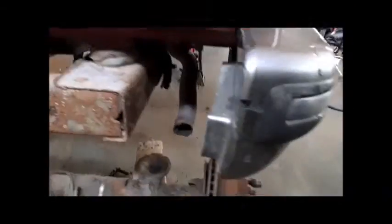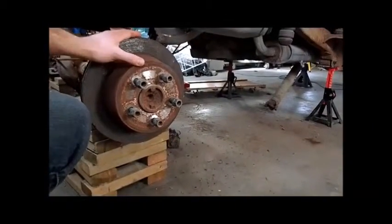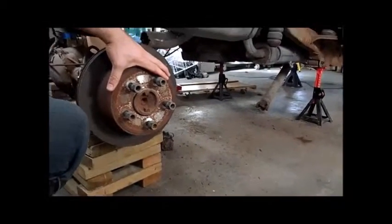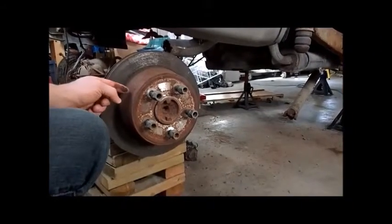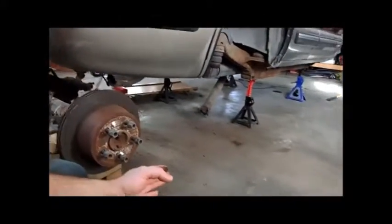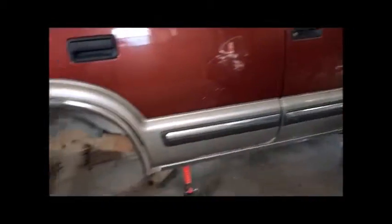I was hoping that the machine could sit with the track a little bit inside, so the track would be under, but I forgot to take into account the calipers and the disc brakes. Given we have an 8 to 8.5 inch diameter drive cylinder to make the drive sprocket out of, with that diameter the edge of the track can only come up to about here, so it's going to stick out and end up making it just over 7 feet wide.